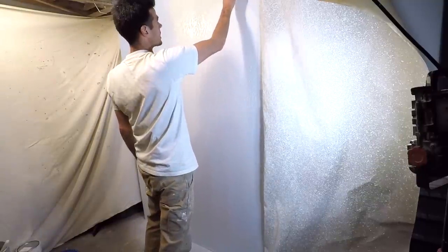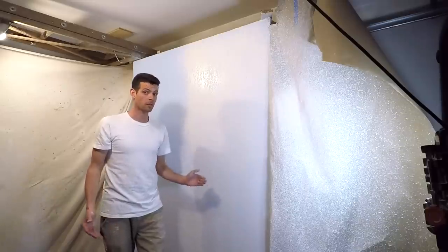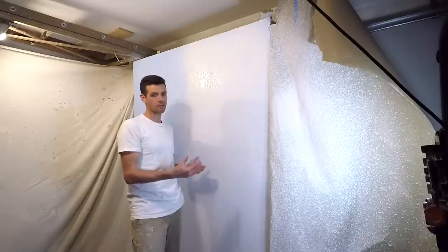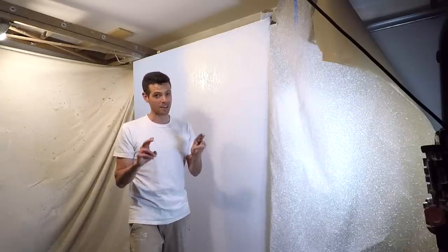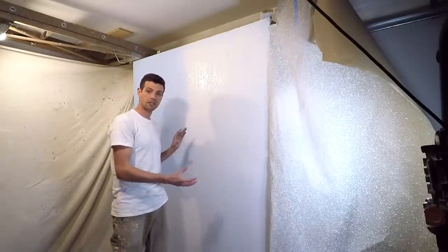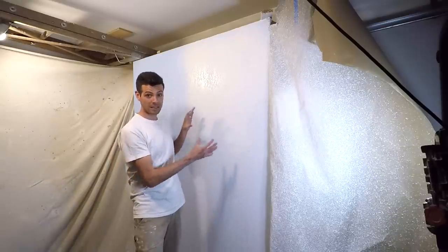I think I'm on the verge of being too late, but it's not pulling yet. This knockdown stuff is kind of tricky. I'm mostly happy with this and I think most homeowners would never pick it apart, but I know pros could see that these flat spots are a bit too wide again. What I did wrong this time was I over-sprayed it and again wiped it a bit too soon — so that timing is critical. To all you pros watching, I want to hear when is the right time to wipe this down and what are your secrets.